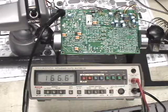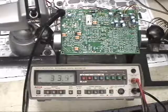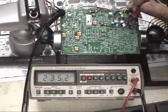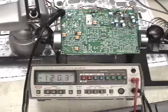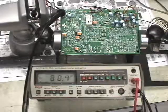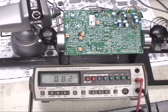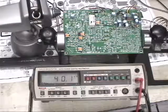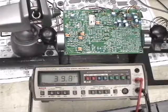I'm going to change the sequence a little bit here. First I'll measure the voltage across the top of R74 while in transmit — we want about 1.7 volts or so. I measure 1.86 volts, which is within the limit, so we're fine there. Setting up now to measure the current: in receive we measure about 8.2 milliamps, and the procedure says around 8 — good. Switching to transmit, I'm reading 40 milliamps; the procedure says 39 milliamps, so 40 is fine. We're okay current-wise.